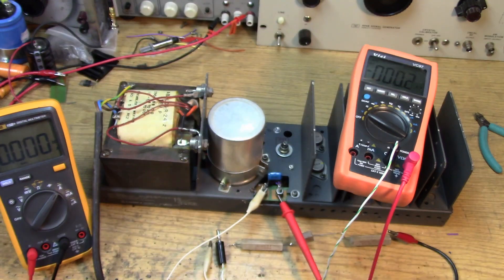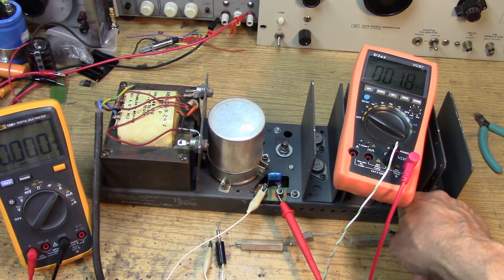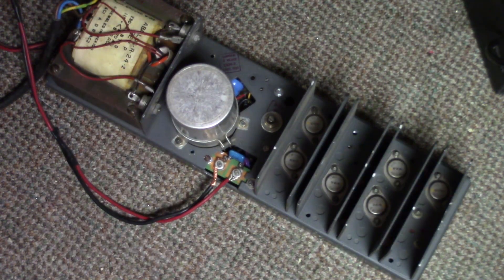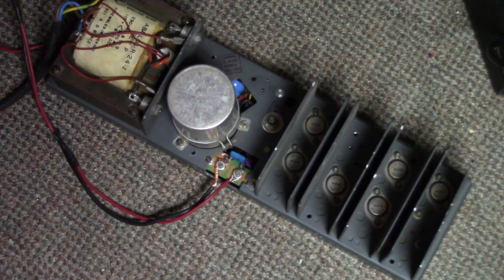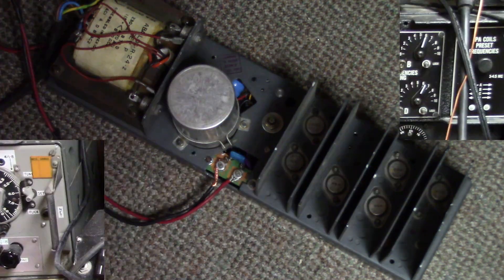At this low current, the resistors are getting very warm, but the TO3 cans are still ice cold - not even feeling it yet. I agree it's not the prettiest hookup in the world, but these two leads are going over to one of my surplus radios - it's going over to the BC652 tank receiver. It has an onboard dynamotor, and hopefully this thing has enough juice to allow it to fire up without smoking.